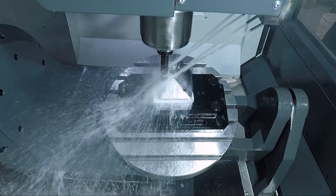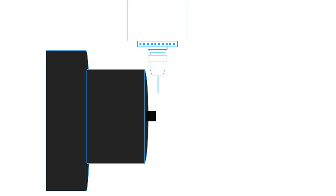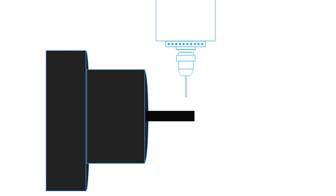This is why bigger is not always better. If you're machining a small part, you don't want a five axis machine which has a really large platter or trunnion because when you tip that up, it's going to make it really difficult, if not impossible, for the spindle and the tool holder and the tool itself to reach down to that part. Same thing with fourth axis — if you have a relatively short part but you have a really large, say, three jaw chuck, you're either going to have to extend your tool out really far or stick the workpiece out far to get access to it.